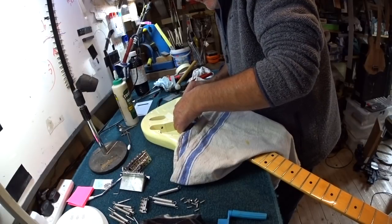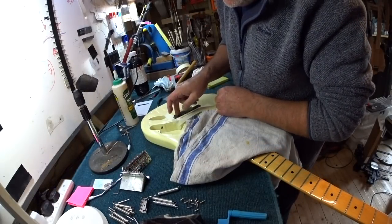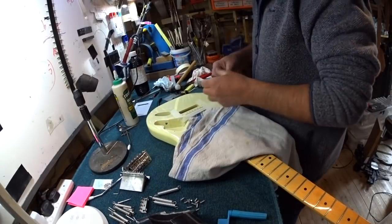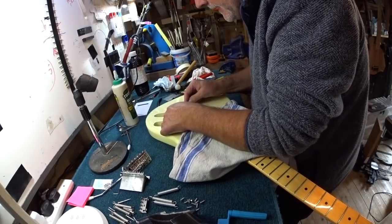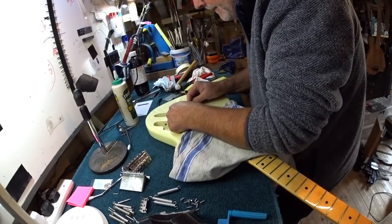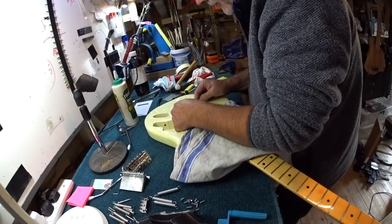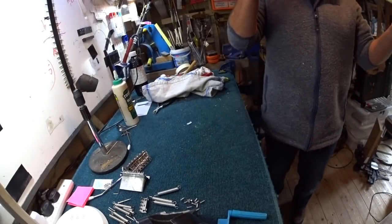And once you've got the bulk of the dowel that's sticking up done, you can remove that protection bit and then come in again and just tidy up. Now, this only needs to be roughly flush. I mean, we're not going to paint it, it's not visible. It's just a filler to secure the material to make it solid again. And the glue will go off and set overnight. So there we are, that's that little modification done.